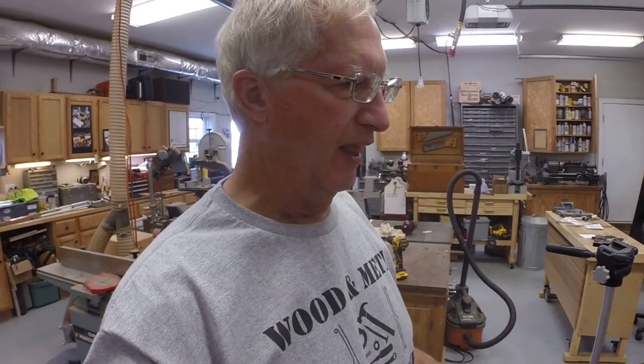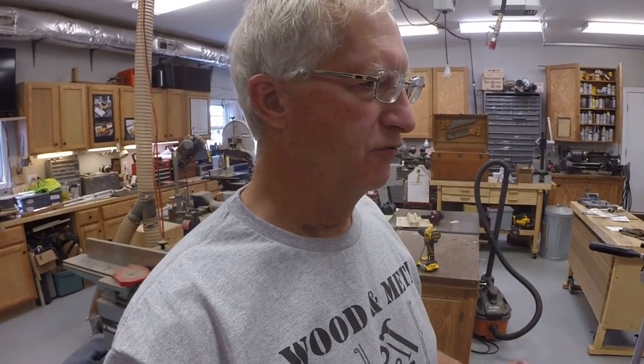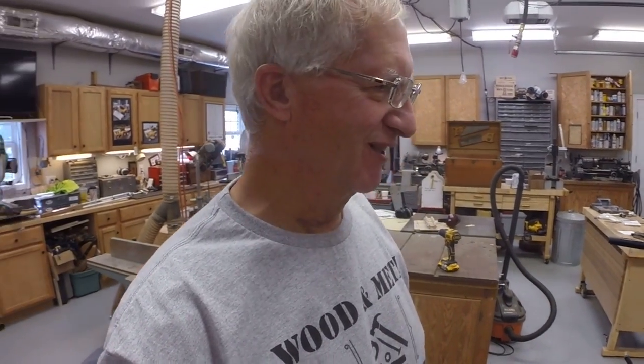All right, they're my little buddies. Okay, so remove the front PTO clutch assembly, modify the starter pulley basket, which I don't need the basket anymore, but I do need the starter pulley to get the shaft ready to receive the drive pulley. And then we'll also clean it up and put a coat of paint on it, make it look like a Cub Cadet engine. All right.